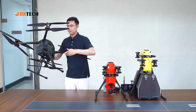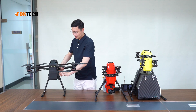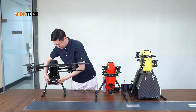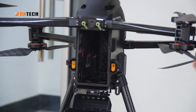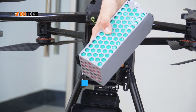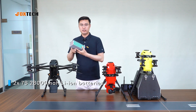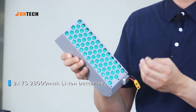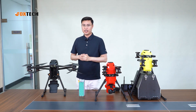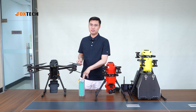You may be curious about how to mount the battery. It is an interesting design — for the first time we put the batteries not on one surface but in a specially designed loading bay that fits two batteries simultaneously. These are lithium-ion batteries at 28,000 mAh each. Each battery is 7S, so together they produce 14S voltage. This gives the Naga Pro very good power and efficiency, which is why it can reach up to 75 minutes of flight time.